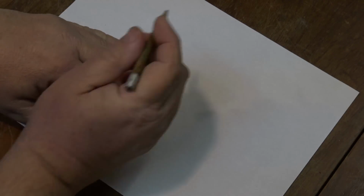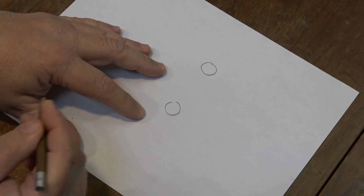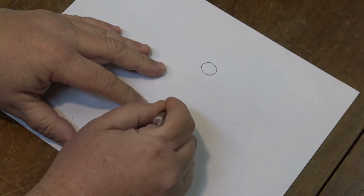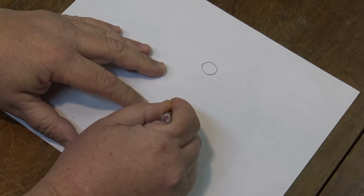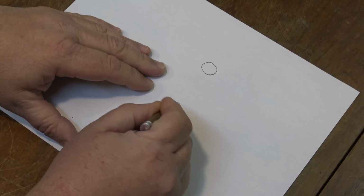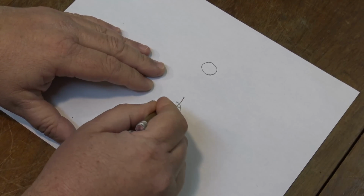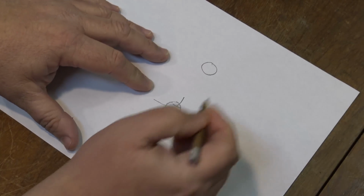Okay, so we'll first start out with a push-pull, a conventional amplifier. And on a conventional amplifier, we have 2 tubes that are outputting the signal. So here we'll represent 2 tubes, and we'll represent our cathode with our heaters. This is our heater, and we'll represent our plate. And I'm only going to draw these as a triode. So here's our grid, and the same on our other tube here.